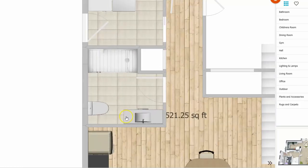Now moving over to the bathroom. Again, I'm going to be creating this wall dividing the bathroom and the mudroom. This kind of setup lends itself well to having this extra space here be a closet, like a linen closet. I'm planning to put the door out here in the hallway so it is easily accessible. Here I've got a 32 inch interior door opening into the bathroom, and this is the existing spot for the toilet. Here is the shower, and as you saw, I already purchased the tub and shower walls, and it's going to be a standard 60 by 30. For now, I put in a 48 inch vanity.